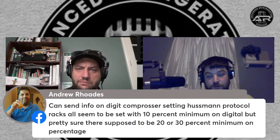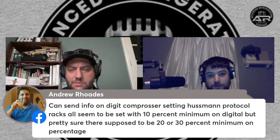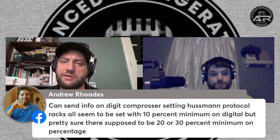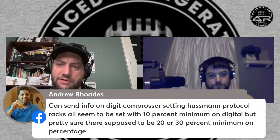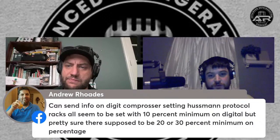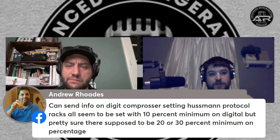I've been running all my digital scrolls at 10%, and I haven't had really any issues. Most of the digitals I see go bad get murdered, usually from flood back or something else. Flood back or high superheat, right? Because then you're already running high temperature and you're just killing it on top of it. Yeah, the number one failure I see in those digitals is a sticking solenoid. The solenoid sticks, it stays unloaded, and it overheats and kills itself.